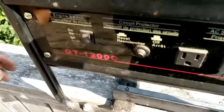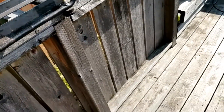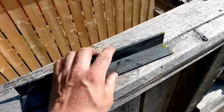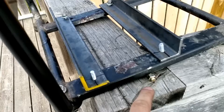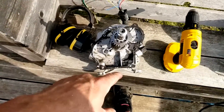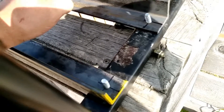It's just I need a basis all the way across so I can build a bracket for the other piece that's gonna come up. Because without these two here, there's nothing to support it. I know it's a lot thicker steel than what's there. So these I am gonna bring in the garage because I'm gonna use the drill press — they're gonna take a little harder drilling than this cheap little steel here. I'm gonna rest that motor there and see where I have to go, and I can mark it right here and right here — that's where I gotta mark it.